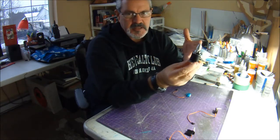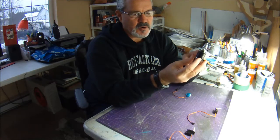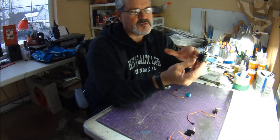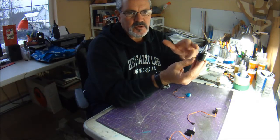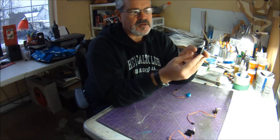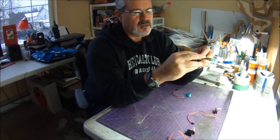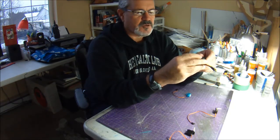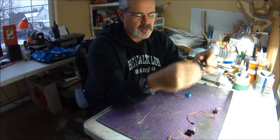The other thing is your plane's going to be fairly heavy anyway, because this motor, I used to fly this motor with a 60 amp speed controller. So this motor and a 60 amp speed controller is about 3 ounces heavier than your standard 2212, 2200 kV, the park jet workhorse motor with a 30 amp speed controller. So you're going to have a fairly heavy plane anyway.